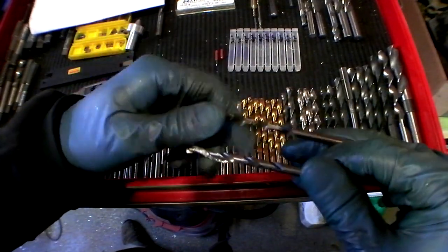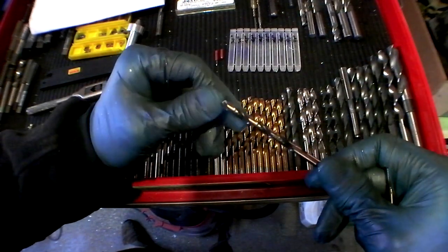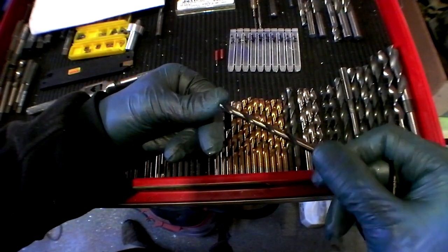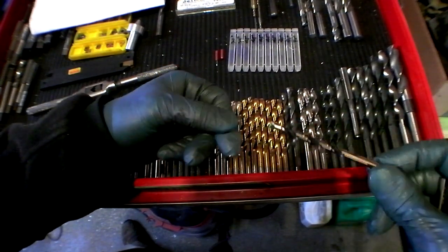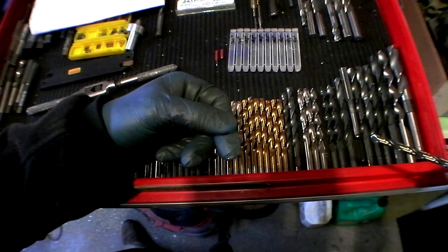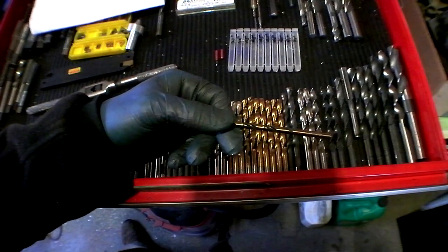So I'm going to put this new one in my CNC holder — they're both new but this one's used once — and try to do some CNC drilling, pecking in an eighth of an inch with full retraction, another eighth of an inch with full retraction, with flood coolant. See what she does.